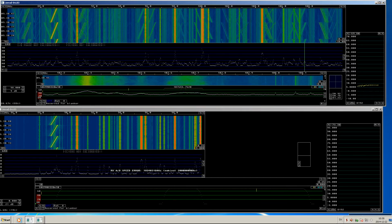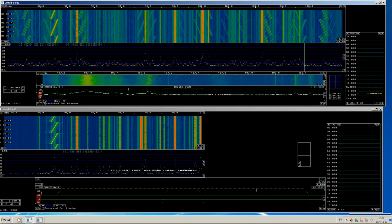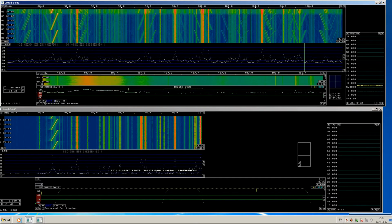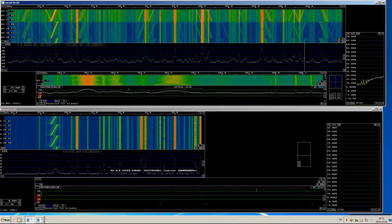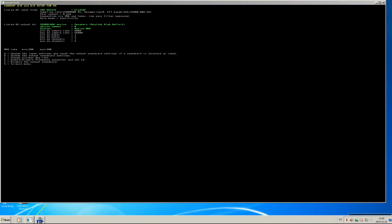Now the Blade RF is running in sensitivity mode, which means that gain reduction is made in the IF while the LNA is running at full gain. Now there is much more gain to have. And as you can see, it does not make much difference because signals and intermodulation products and everything goes up to a similar amount. I have made the Blade RF screen bigger to make it easier to see some of these things. Gain mode is sensitivity, as you can see.